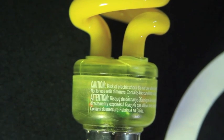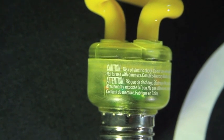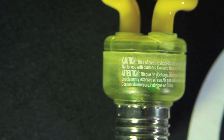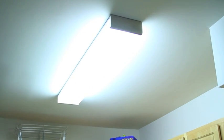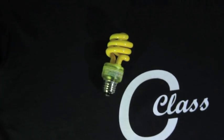Fluorescent lighting — everyone knows what fluorescent lighting is: the long white bulbs. This too is a fluorescent light bulb; its new design enables you to screw it into a standard light socket, but the ballast is contained within the bulb itself and not the fixture. Note the caution label — it says 'not for use with dimmers.' If the circuit you're working on has either of these types of lights, a dimmer switch will not work. The entire fixture would have to be removed, or you only need to replace the bulb with an incandescent or halogen bulb.